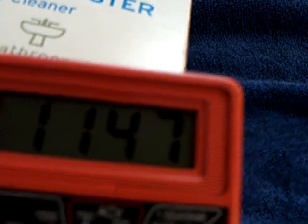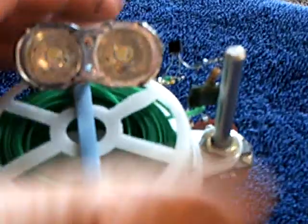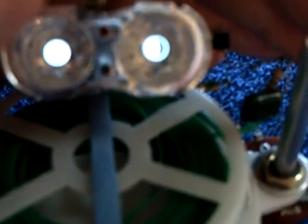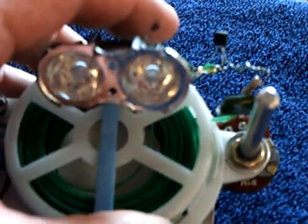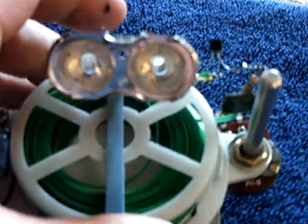It's about what it was last night before it totally dried out. I don't know how long this is going to last, but what I was trying to do was replicate basically this penny oscillator that was using the same chemicals — only cooked on a stove — which was alum, salt substitute, and borax, just heated with no water on it. That formed this crystalline battery that's been running this thing for a month. It's not dropping any voltage; it's staying around 0.9 volts.